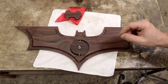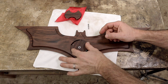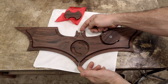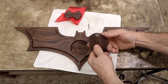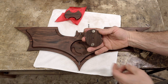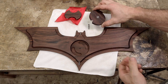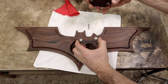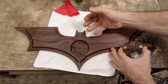I want to show how this works for final assembly. The center piece is a pin that holds everything in — it's just made from a nail with a head still on it. What we have here are some steel rods cut from the nails. There are some grooves here for magnets to ride in. The magnets are doubled up because I found that one magnet was simply not strong enough to work through the wood. There are also magnets on the ends and they are going to suck in the shafts. In the center is a bearing to prevent binding when I assemble it. The key will be placed on the outside and lined up with the magnets on the ellipse — it will hold in place and allow me to twist it. By having the grooves it makes it deeper and will have less thickness of wood for the magnetism to go through.